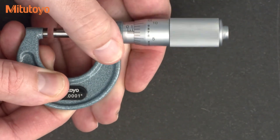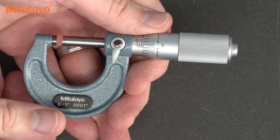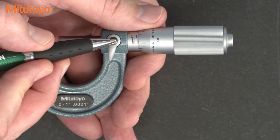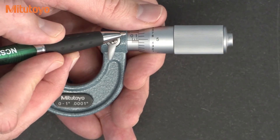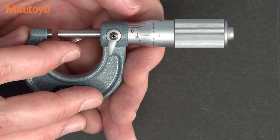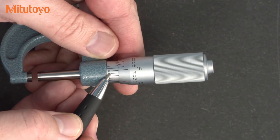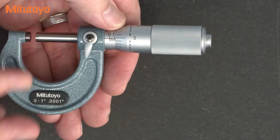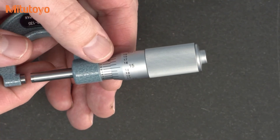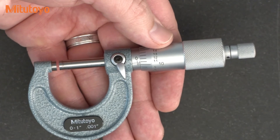You might be thinking it's easier to read halfway. Let's pick something a little bit harder. So let's grab that spot right there — just randomly picking a spot. Now we're asking where does this line hit between the four and the five. It looks to me that we're way past half, maybe about three-quarters. I'm going to say it looks like 0.7 or seven tenths. We rotate over here and sure enough, there's a seven-tenths line that lines up best on the vernier. So in both those cases, simply reading between the lines, we checked ourselves using the vernier — which means we can do the same thing on the non-vernier mic, reading to a tenth just like that Mill Standard from 1950 told us we could.